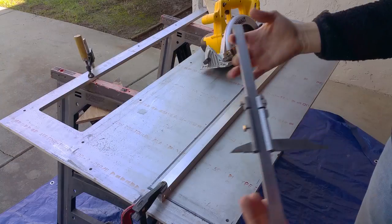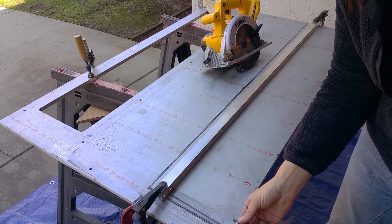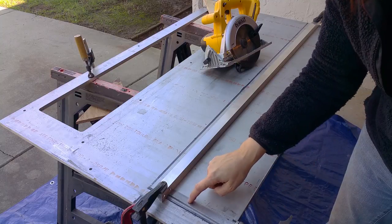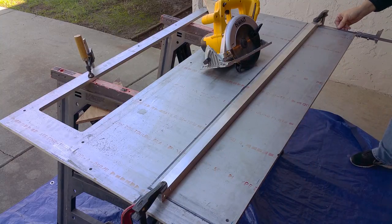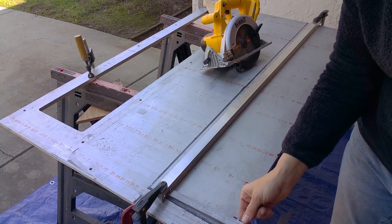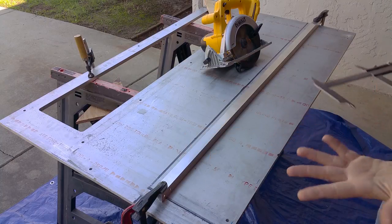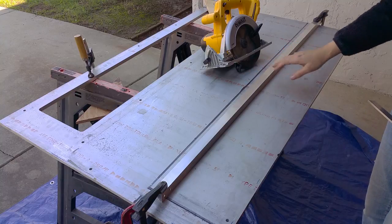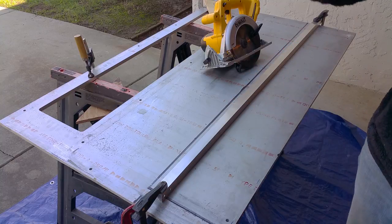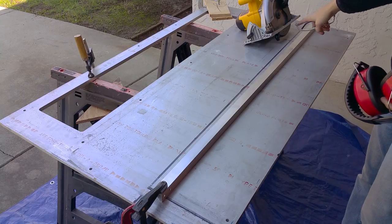Like so. I use this big caliper kind of as a depth gauge to measure this accurately on both sides. I set it up with a couple of teeth on this side, and then transferred the measurement over here and got about the same place. And you know, you can only do so much. This will probably bend a little bit, but it seems okay. I want to be careful with this. This is actually a part for a big 3D printer. I've got the depth of the saw set so it's not too deep.